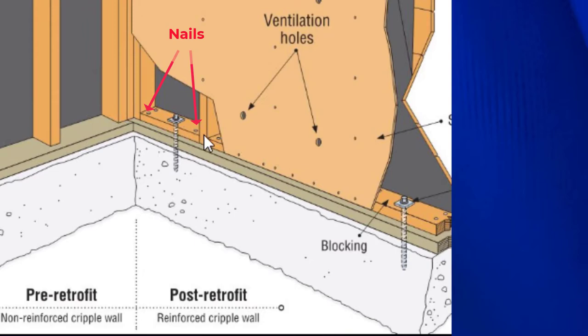And what they've done now is they take this piece of plywood and they've nailed it into the block, probably every 3 inches, which is what most of the codes say, or every 4 inches. And so what'll happen is if this nail goes right at the end of the block, it'll split it. So let's say you put one nail right here, it splits it, then you come over here and you split another one. Or let's say you're nailing it and you hit this, go right in the crack right there, that nail is not going to do any good.